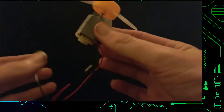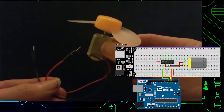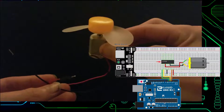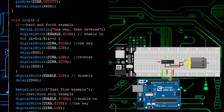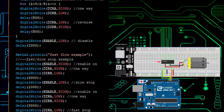First let's look at DC motors. DC motors are pretty basic. They use just a direct current, and when you supply power to them one way, then they turn one way. If you supply power to them the other way, then they rotate the other way. They're good for fast, continuous RPMs, and you utilize PWM to control the speed.